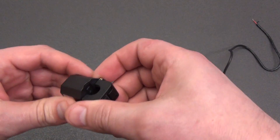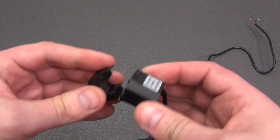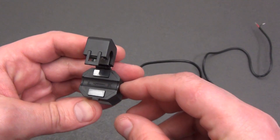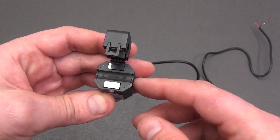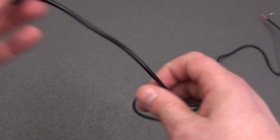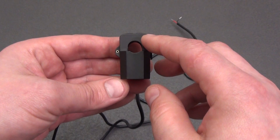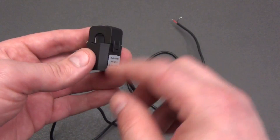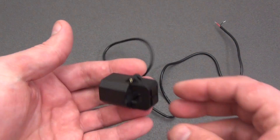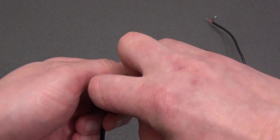We disconnect the two halves of the current transformer — on one side there is a plastic loop with a metal pin, on the other side a plastic latch. The maximum wire diameter is 10 millimeters. An arrow marks the direction of connection from voltage source to load. The operating principle is based on electromagnetic induction. The transformer consists of a steel magnetic core and two insulated windings: the primary winding with fewer turns connected in series to the measured circuit, and the secondary winding connected to a measuring instrument such as an ammeter.